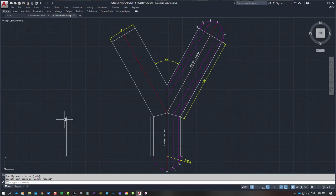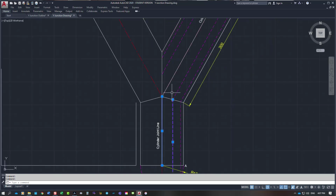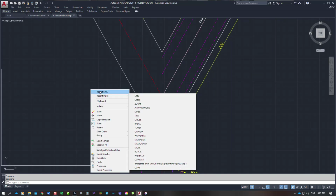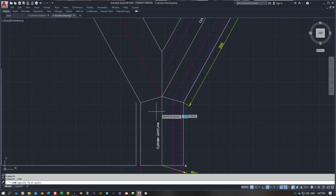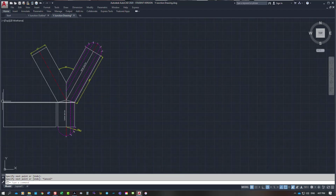What I need to do, sorry, I'm going to grab that line and go up slightly. What I need to do is project these points, where this pink point is here, the next one, the blue one, or the pink one there. These are my heights that I'm looking for. This one here as well. So these go across the sheet, and we project them 90 degrees, or perpendicular, to the lines that we've got here. They're going to go straight across perpendicular.